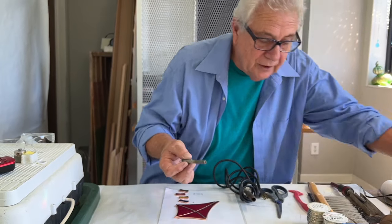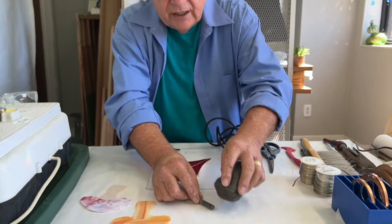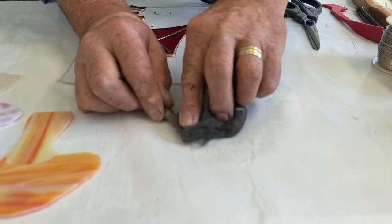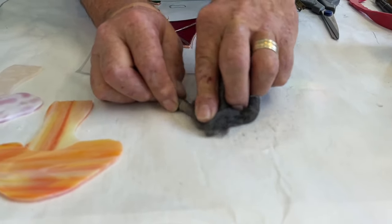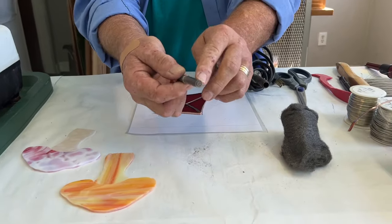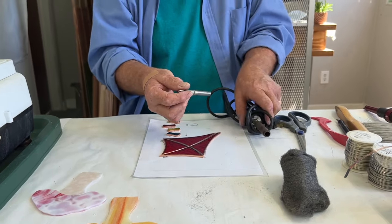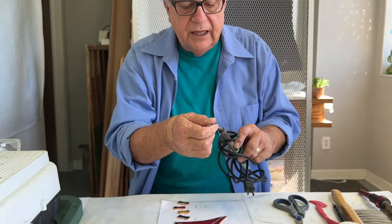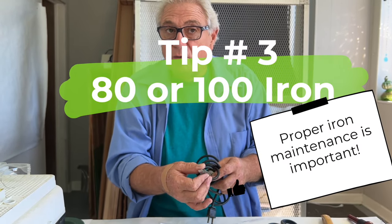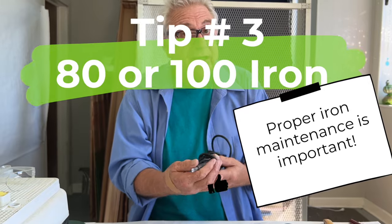because it does remove so easily, your job on this tip is to keep the heat down near the bottom. I'm just going to show you a little trick. If you take your tip out and steel wool it and get rid of any of that corrosion right there, the heat will go back down into the tip much easier, and you'll find that there's really nothing wrong with your iron other than that you need to clean it a little bit.